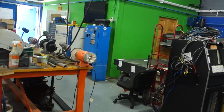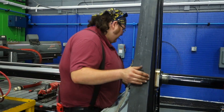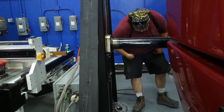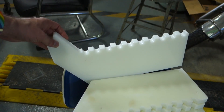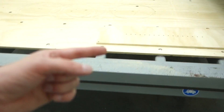While that's going on, Batman is working on making a drilling jig. Batman's making a drilling jig because over the course of the weekend we made these — can you identify what these are? We have to drill a pattern of holes in the bottom: a whole series of quarter-20 threaded holes on one-inch centers. That's going to be the drilling jig, and it's going to be cut in this pattern. So that's coming together.